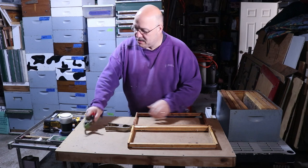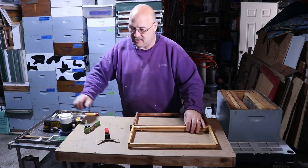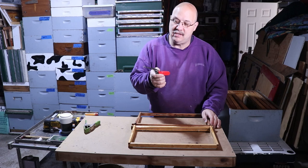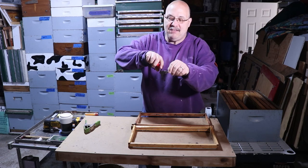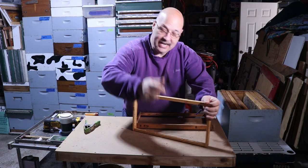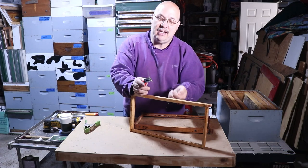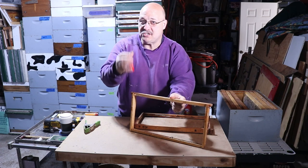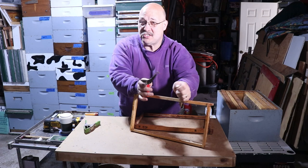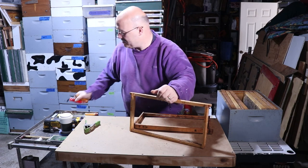Now this is a specialized tool from the automotive industry. I've used a bunch of different tools including the glazier tool and hive tools to scrape the grooves, but this tool is just perfect. It's used in the auto industry for molding on windows — it's got two wings with a slight curve to them, which makes a perfect indentation to go in and clean out the frames. I don't know how I came across it; I'll have a link in the show notes.